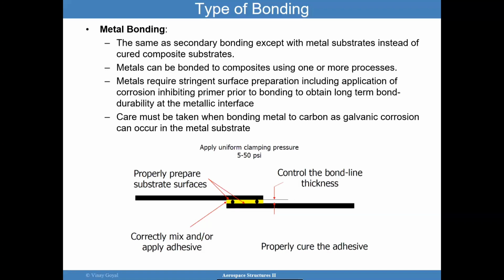So you may want to move to a metal that does not have a coefficient of thermal expansion that's as high. Invar is such a material. However, you have to balance the expense, the cost, the weight. All these considerations should be thought about in the application of interest.